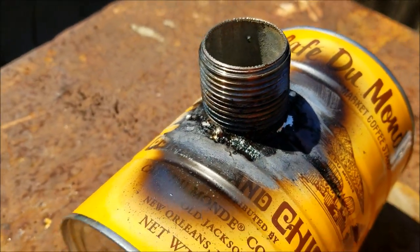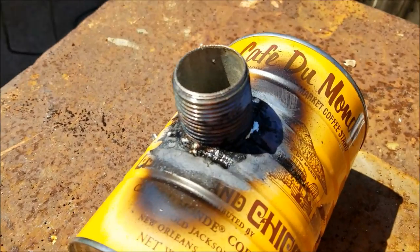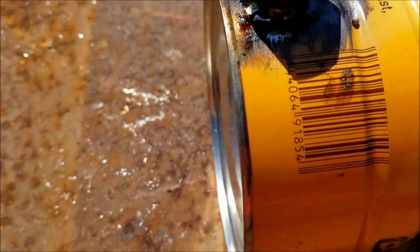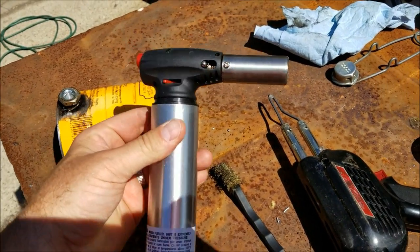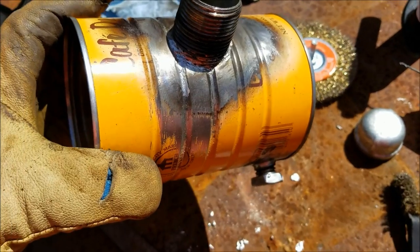I think I got a pretty good purchase. There's a big glob of solder here that I'll clean up with my solder gun, but the torch is a quick way to do it — you just have to be careful not to burn through the can. It looks like I got a good solder all the way around. I soldered the petcock fitting in the bottom as well and got a good purchase on that too. I'll let it cool and clean it up. Some people have small kitchen torches for crème brûlée — I used one to touch up the solder and smooth out the blobs.